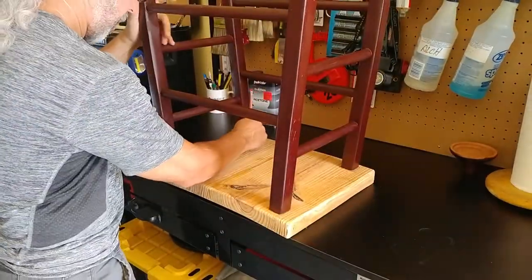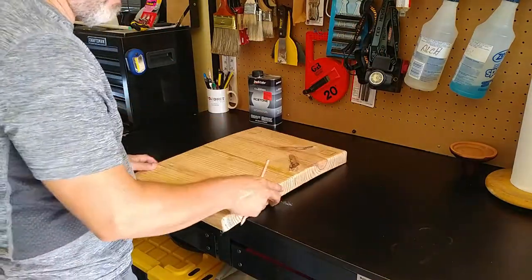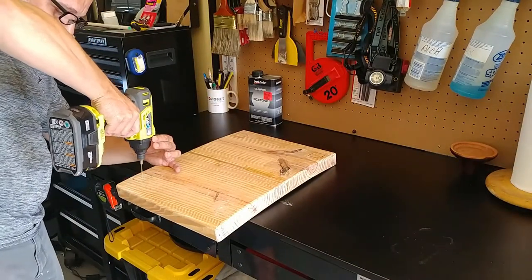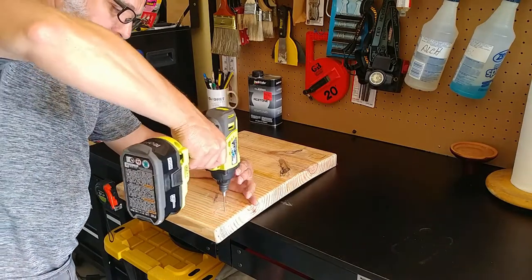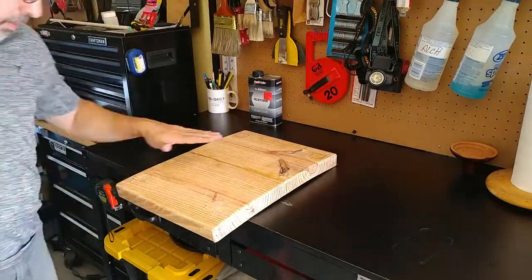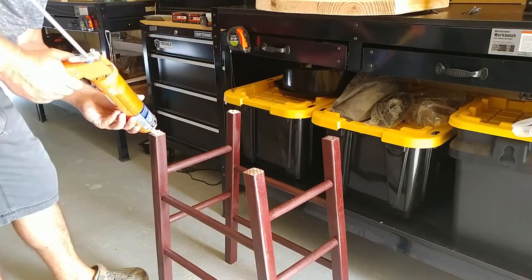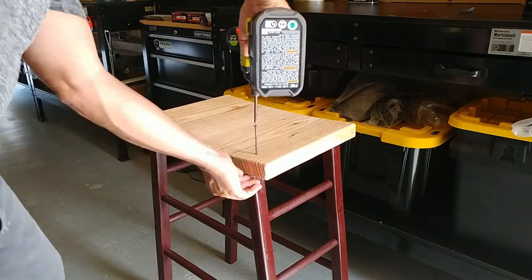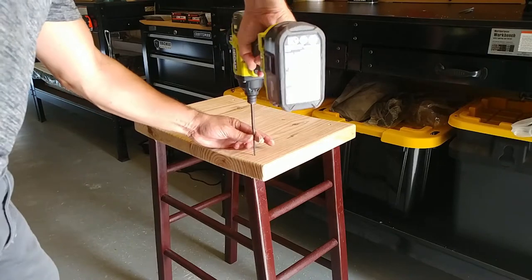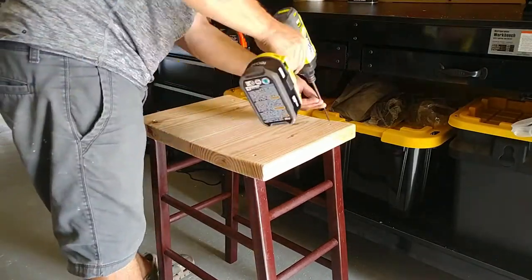I even cheated a little bit by resting the legs on top of the seat and tracing the contact area so that I could drill pilot holes from the bottom. I originally intended to use dowels, however I didn't have anything bigger than a quarter inch and the two pieces didn't quite sit together perfectly. For this reason, I opted to use liquid nails and screws instead. Whenever you have two pieces of wood not quite meeting perfectly, liquid nails is always a good way to cheat. Although I'm using screws, I sank the holes deep enough so I can come back and insert dowel plugs over the heads at a later date.